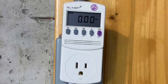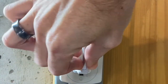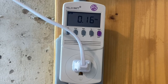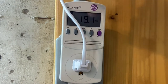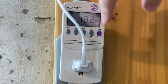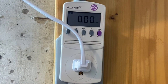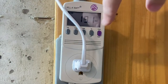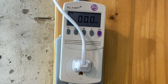I'll jump back to the amp setting. I've got just an LED light mounted under the cabinet up here, and I'm going to plug this in — of course it blocks the view. On the amp setting, this LED light is using 0.15 amps. Hitting the watt button: 19.2 watts. This pulls so few watts — 19 to be exact — that it is less than it will register on the kilowatt hour scale.